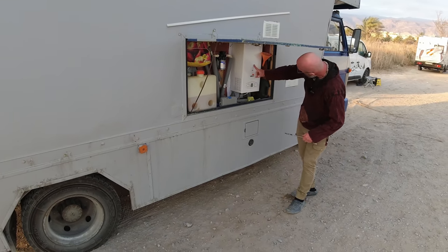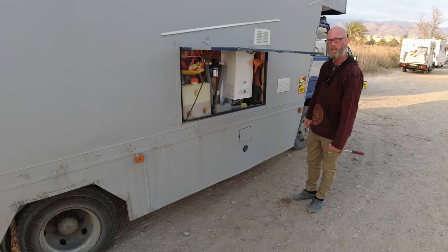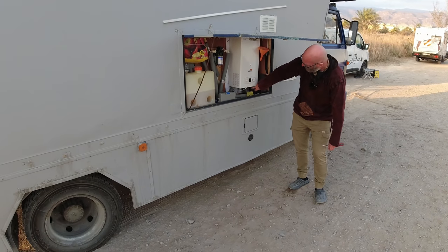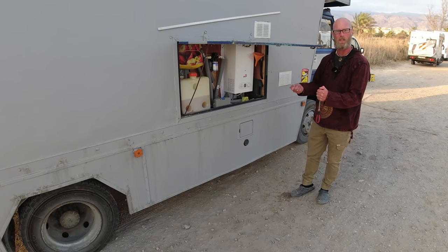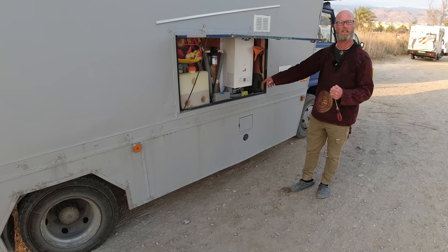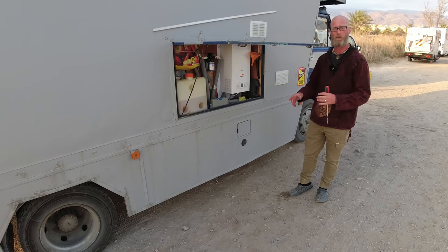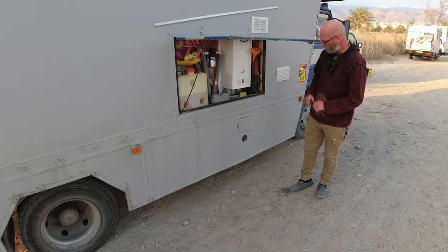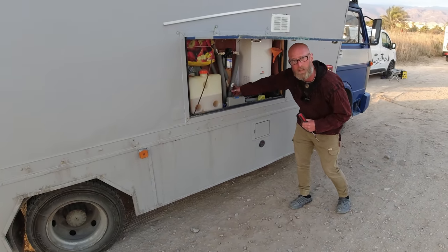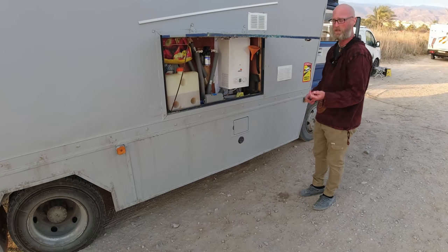So yeah, independent tank — it's just down behind there. There's our water heater — our second water heater. The first one broke. These were plastic pipes originally on the old one, and it started doing this thing where after you'd used it, about 20 seconds later it would fire a jet of steam which would instantly melt all the plastic fittings. I had to put copper on — it lasted nearly another year before it made that same noise and just kind of exploded. So that's the replacement, hopefully it's going to work. All the pipes are now lagged after we discovered they all freeze at minus six.